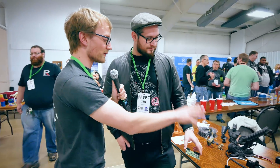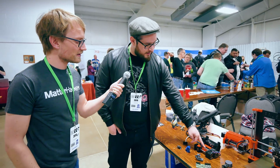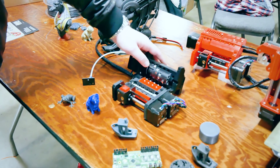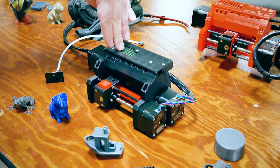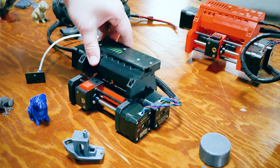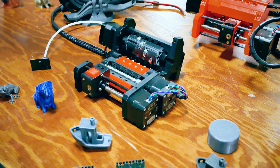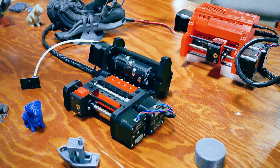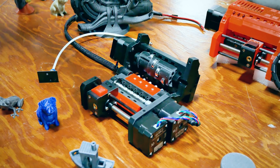So you have three drivers, three motors, but you're doing five filaments. Can you describe the revolver system? You have five extruder pulleys and a selector with idler bearings. By rotating the revolver, you select which drive gear will engage with the filament, so it only presses down on one filament at a time. Then you have a Bowden tube going out, so it parks where it needs to go — you don't have the splitter where we got a lot of jams in the previous version. And if the filament fails to load into the main extruder, it backs up and there's actually a blade on it, so it can cut off the end and try to load again.